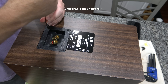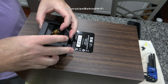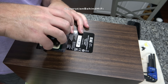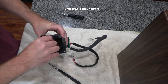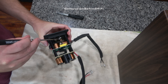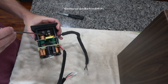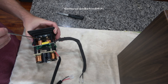The terminal cup for the DBR62 is held in by four Phillips head screws. The terminal cup and crossover are integrated, meaning the crossover is mounted directly behind the back side of the terminal cup. Getting it out was a bit challenging because the crossover is fairly large. Testing the binding post and crossover for ferromagnetic materials: the binding posts themselves are not ferromagnetic, but the nuts fastening them to the terminal cup are. The tabs connecting the crossover to the binding posts are not ferromagnetic, which is nice. You can easily replace the ferromagnetic nuts with brass nuts — I'll leave links in the description.